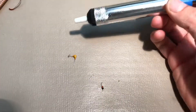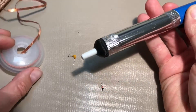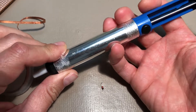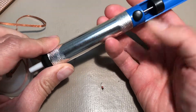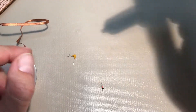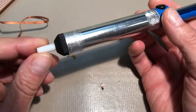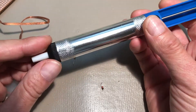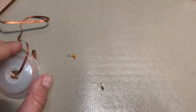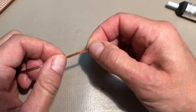Maybe it's just me, but I can never get these vacuum plungers to work — never, never, never. You're supposed to press down on this, put it on the solder you want to remove, press the button, and you get this instant vacuum that's supposed to suck it right up. I don't know — again maybe it's just lack of practice, but I've had no luck with these. With the braid I've had better luck, but again it's difficult.